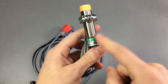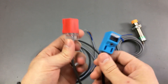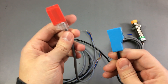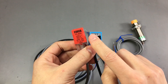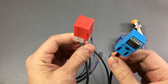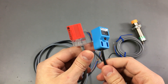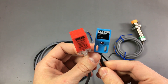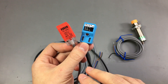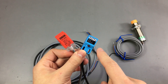In terms of range, this capacitive type sensor is the one you want to get. I've also got these other two as backup because it took more than 2 months to receive these, so I wanted to make sure I get at least one that does the job. These have a different style of package and will require a different mounting technique, but Creality uses one like this for the CR10S with auto bed leveling, so you could find some mounts ready-made on Thingiverse. I'll probably do a video soon comparing these sensors and showing how well they detect proximity to the printing surface with a sheet of glass. Until then, links for these will be in the description below.